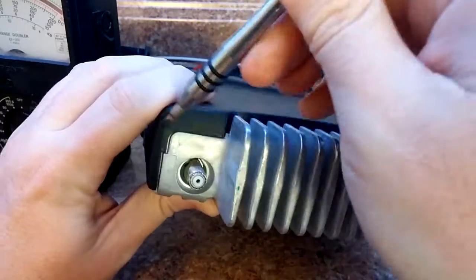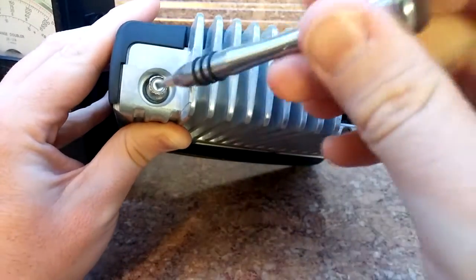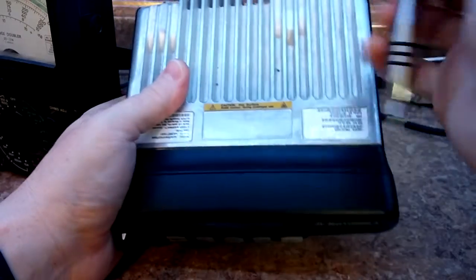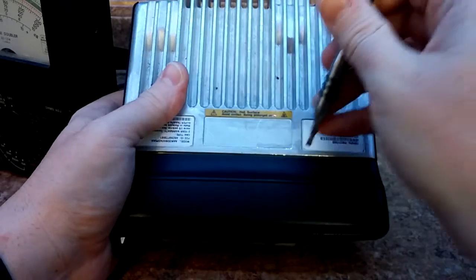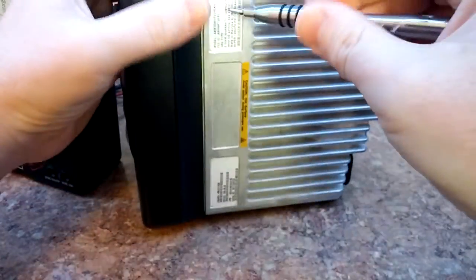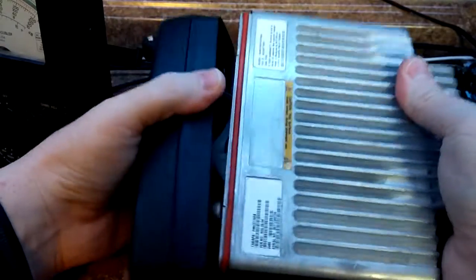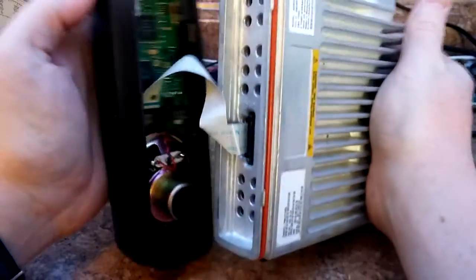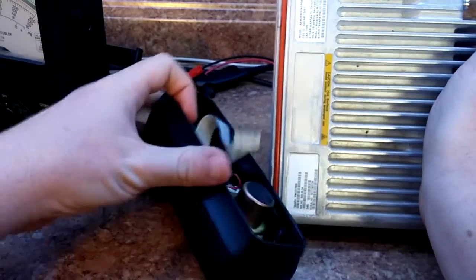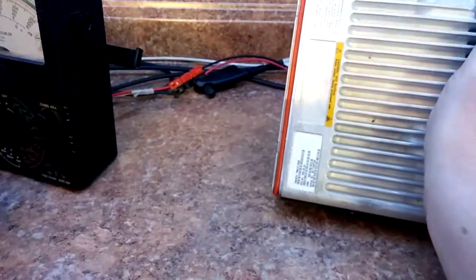You can see the accessory connector back here that you'll use for all your repeater stuff — that funky power connector. Motorola uses these connectors here, but what can you do? The radio is cheap and they work okay. They're better than a PL259. First thing we're going to do — they make a special escutcheon tool for this, but you just get a little screwdriver underneath here. All this thing does is snap on. Get it loose down here as well — two on the front, two on the bottom. It comes apart like this, and this is just a little ribbon cable. Don't worry if you break it — you can get these on eBay for about $5. They're still available and pretty hard to break.